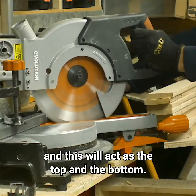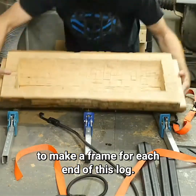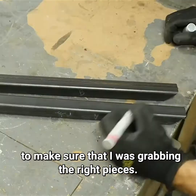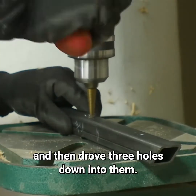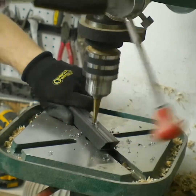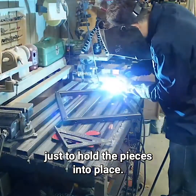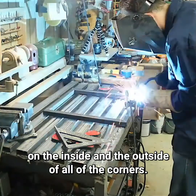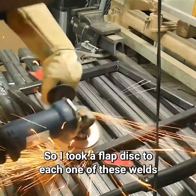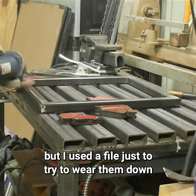I cut that piece down as well — these will act as the top and the bottom. I followed the same procedure to do the uprights for each frame and ended up with eight pieces to make a frame for each end of the log. These are a little taller than they are wide, so I made sure to lay them out and grab the right pieces. I drilled three holes down into the top pieces using step bits to get a larger hole at the top and a smaller hole at the bottom. I laid out the frame, made sure all the corners were square, then put a tack on each corner to hold the pieces in place. Once I had a nice tack, I went back and did full welds on the inside and outside of all the corners.